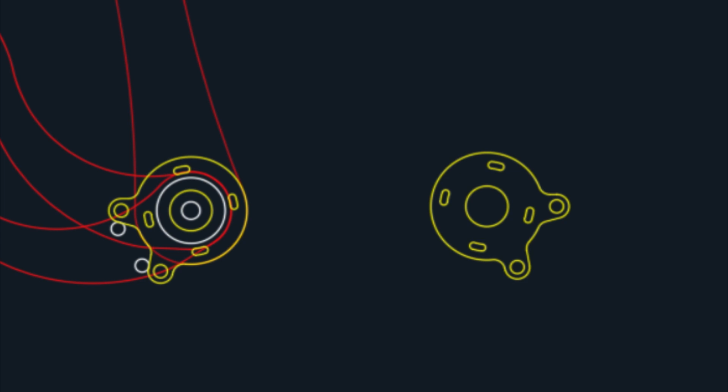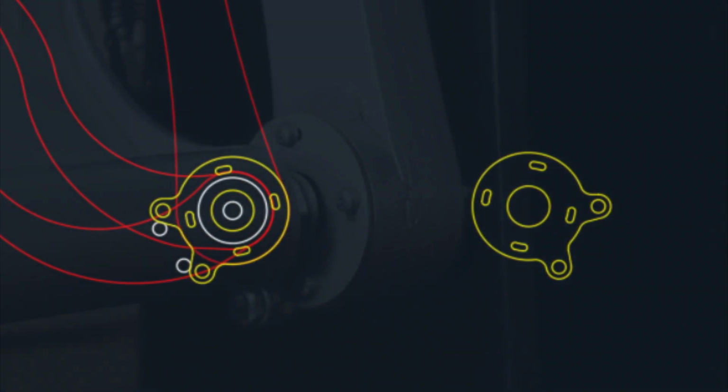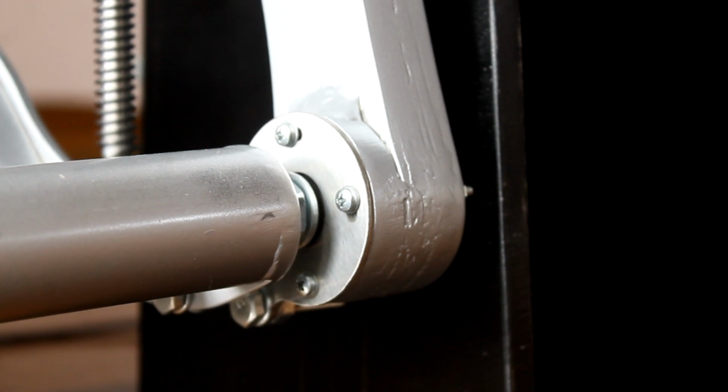This piece is used to limit the motion of the toe brakes. It's cut out of 2mm stainless and screwed into the swinging arm. I cut out slits here instead of holes into it so that the angle of the pedal can be adjusted.